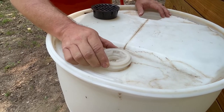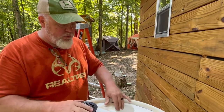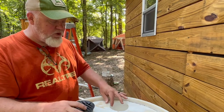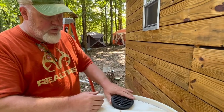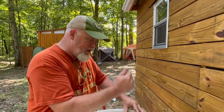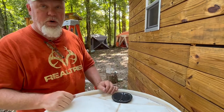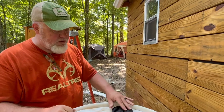The openings on the barrel are a little bit too small for what we wanted to do, so on the other side of the barrel we cut out with a jigsaw a little bigger circle that we can put this into. Where the water comes from the drain it'll go directly into here — it's already in a recessed area so it should allow the water to go in fairly easily, and it's got a little grill to keep most things from going in.